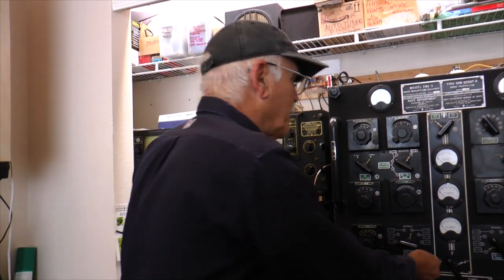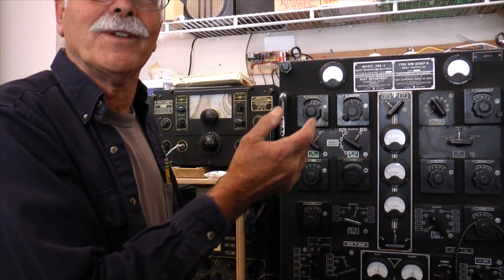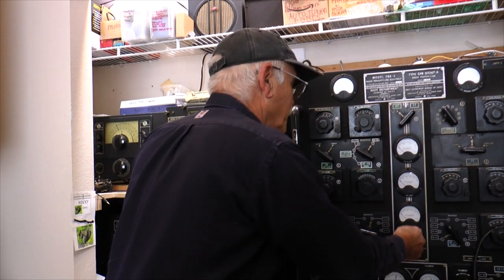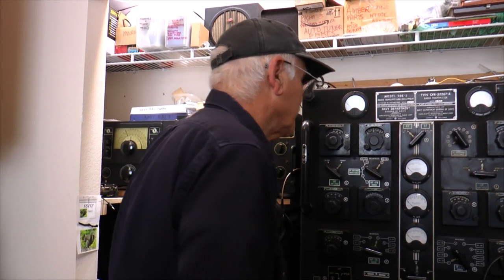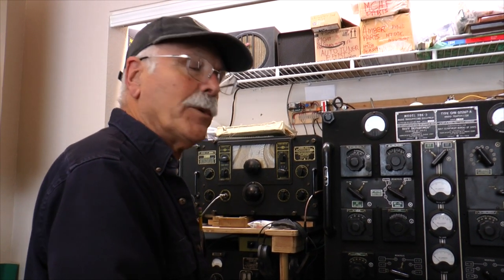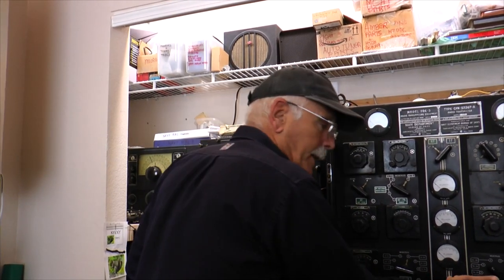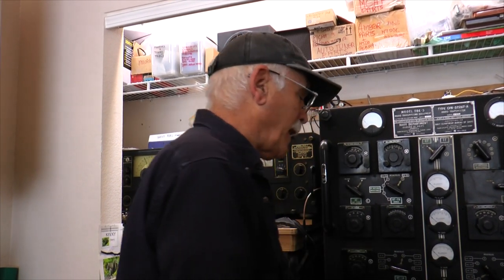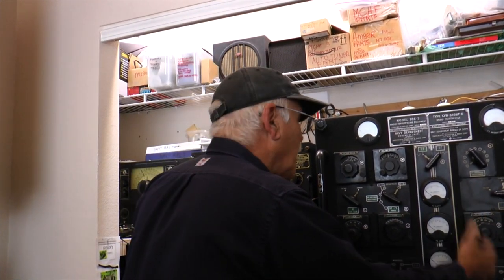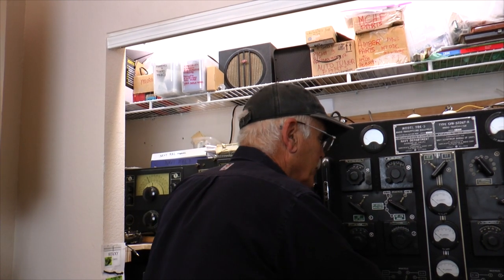And then the other issue was to come up with the detents for three positions. So I machined a new detent plate. It's mounted behind this. Of course, it's all rebuildable. It's all set screws and hardware. There's nothing riveted, glued, or soldered. That's how they made them. Yeah, so it's totally rebuildable. You could have a shipboard kit of contacts, springs, detents, everything, and you could rebuild pretty much anything.